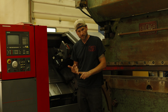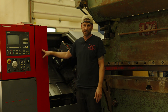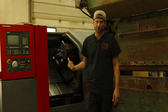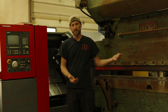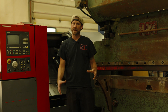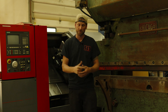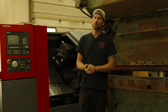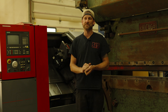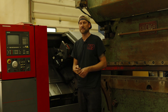So number one — this is made by Emco from Austria, called an Emco Turn 360. Because it's from Austria, this runs at 400 volts, three phase. Now the mains coming into my shop are 240 single phase, but I already have a giant rotary phase converter to run another CNC machine, providing me with three phase power. So all I needed was a transformer to bump me up to the 400 volts this machine requires. Not impossible, but remember there's a cost associated with that.